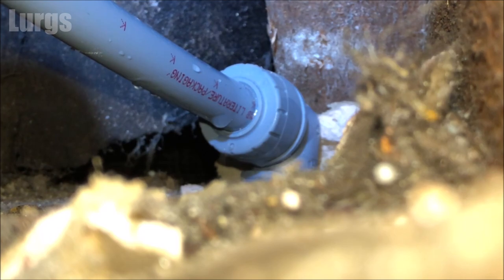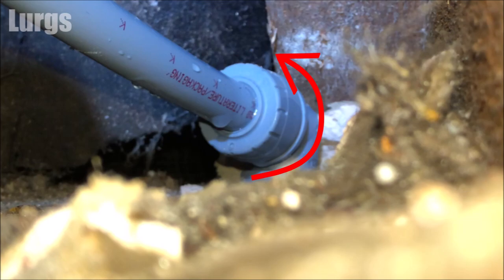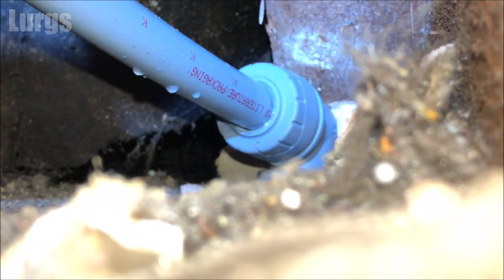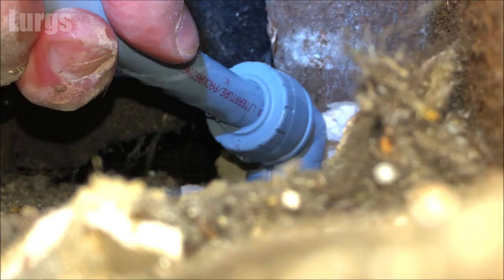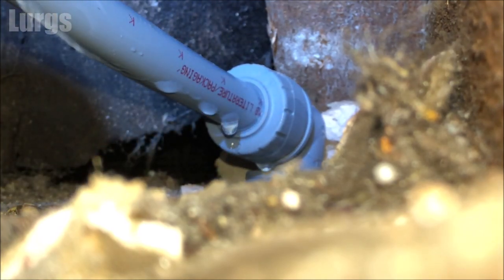What I'm going to do first is gently unscrew this anti-clockwise one or two turns, and then push the pipe all the way home into the elbow, and then tighten it back up again. I'm now going to push the pipe inwards — it may spray a bit of water out even though the mains cold water feed is off, because you've still got a bit of pressure in the pipework.